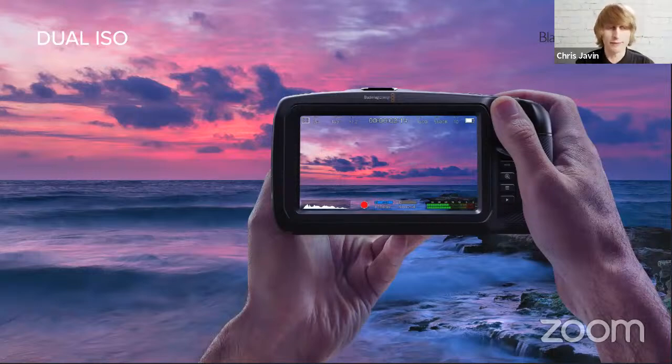We combat the low light through our dual native ISO, which goes up to 25,600 for HDR images and incredible low light performance, with native low gain and high gain at 400 and 3200 ISO respectively. As a result of this, you get flexibility and adaptability of choosing your desired ISO to retain integral dynamic range, sensitivity, and latitude.